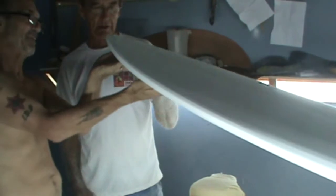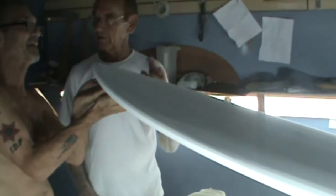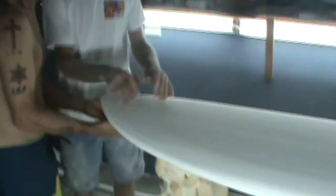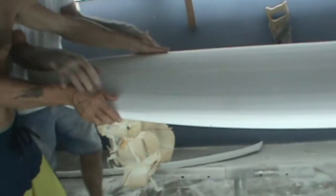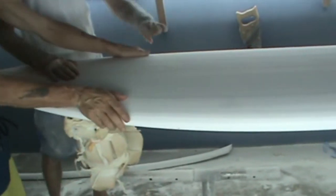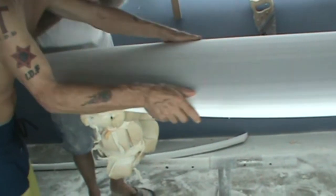Are you putting a V bottom? No. Like flat, a V, flat. A little V in the tail. Okay. Okay, now set it down. You've seen me do it 30 times already. Take your hand and feel it. It's rough, but it better be similar thickness, similar slope. Right. Or I better correct it before I start sanding. Yeah, just a slight rock.